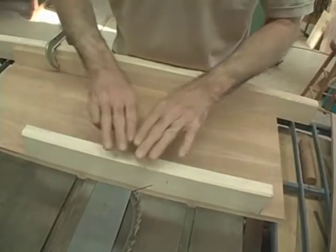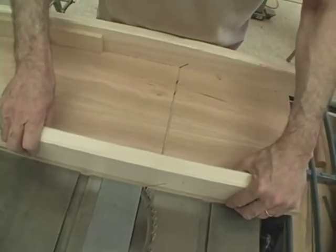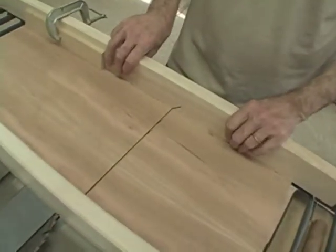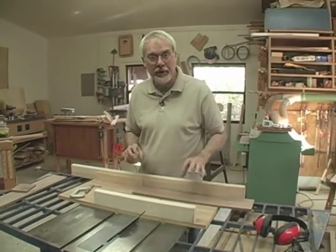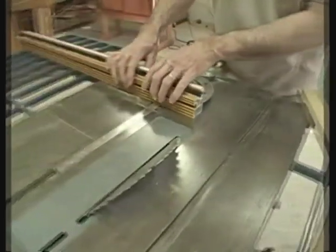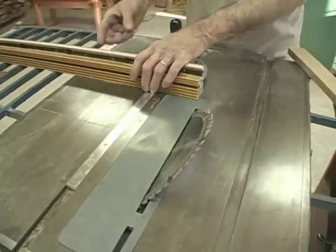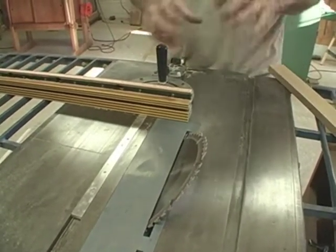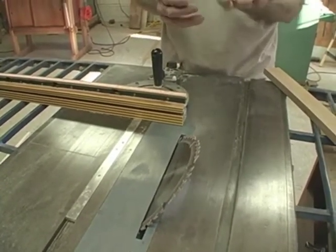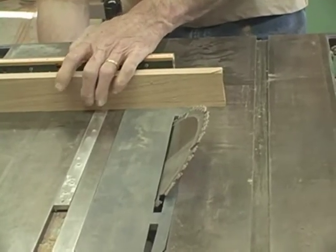With this, I need a very secure, strong piece at the front to lock the front part together, and then the fence at the rear. There are certain steps to perform before you make your first cut. I use the mitered gauge first to test the angle of the blade, so that when I put the sled in place, the sled isn't going to be cut by the blade being slightly off in its angle, and that will help to preserve the sled's accuracy.